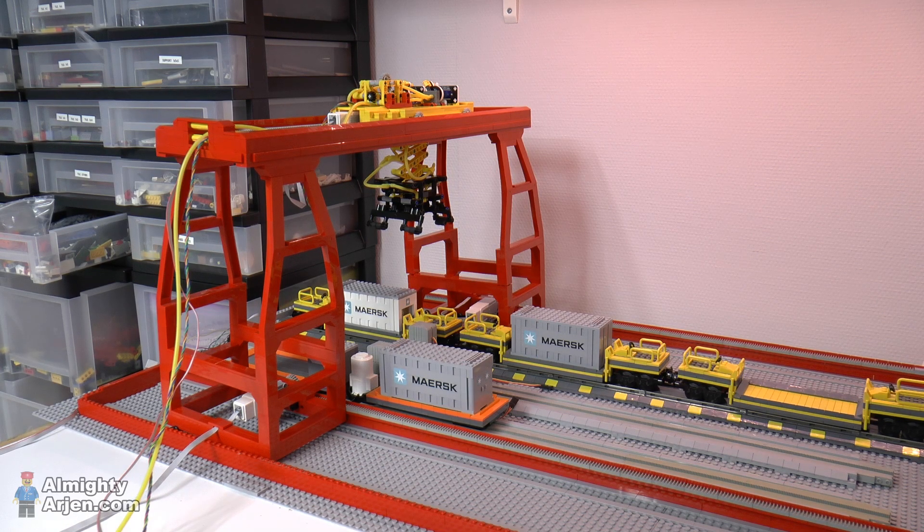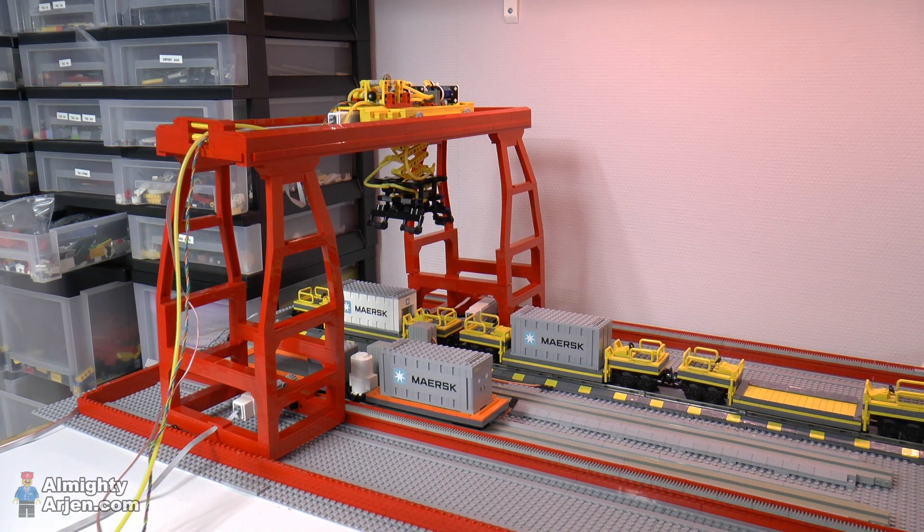One possible cause is that only one side of the support is motorized, which creates twisting inside the support structure. That's the first thing to try. If that's not the issue, maybe spacing needs to be added between the support and the structure around it, though that's tricky because a tight system is needed to keep the crane in place — wheels might be needed to lock it. So the first attempt will be motorizing both supports on both sides.